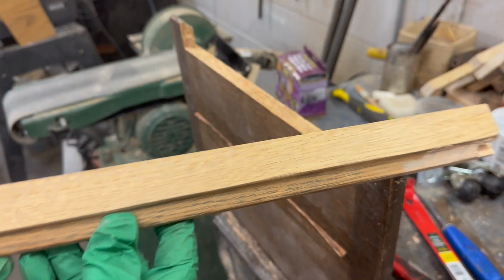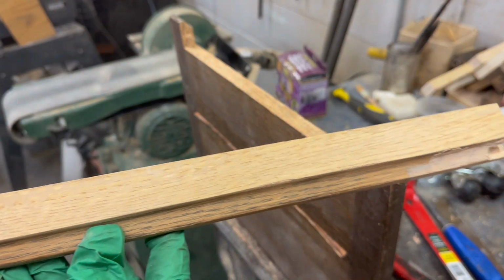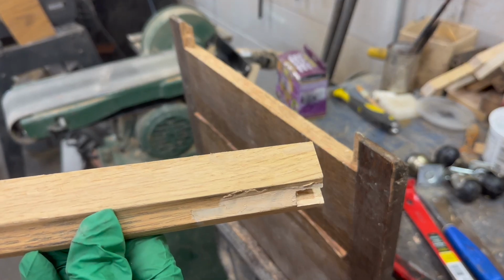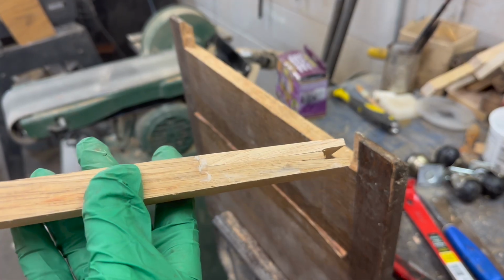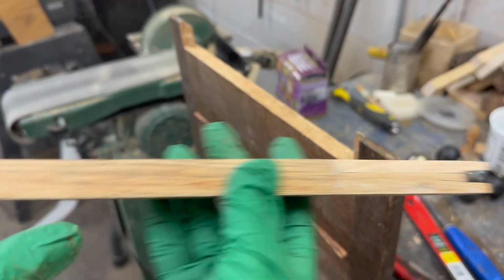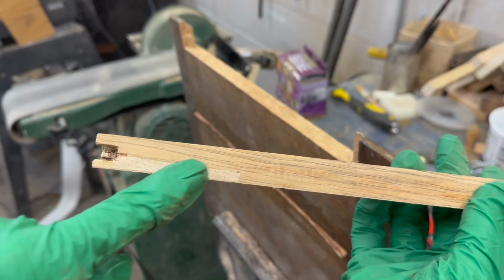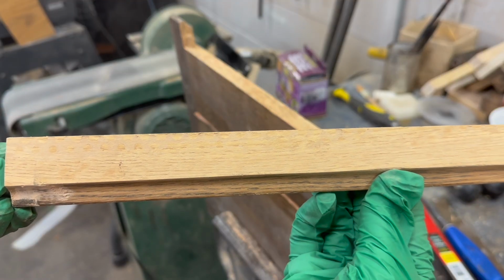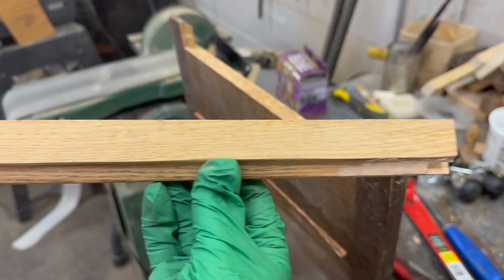And I've been working on this piece here. The top piece had a big chunk of wood out of it that they still had, but it wasn't fitting very well because it had been glued before. So we actually ended up putting in another piece, you can see on this end here, and then veneering the whole front face of the surface so you just can't tell that that was replaced there.